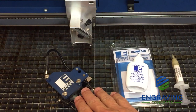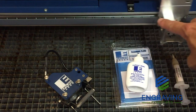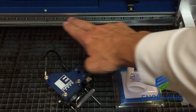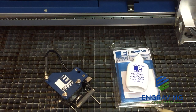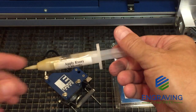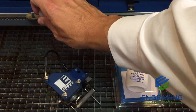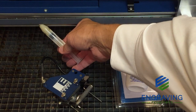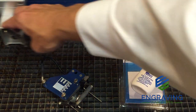A little bit of cleaning goes a long way on any laser system. You always want to keep your optics, lens, and mirrors clean and free from dust. Now we are ready to lubricate the bearings. The linear bearing guide is right behind the belt — this is the bar that runs the length of the x-axis carriage, and there are two grooves that hold the white lithium grease included with the laser system. We want to apply the white lithium grease on the top groove and the bottom groove of the bearing track. We recommend applying this every three months — wipe out the old grease and insert new grease. Apply it the length of the carriage, then with the machine powered off, move the lens assembly left and right to work the grease into the bearings.